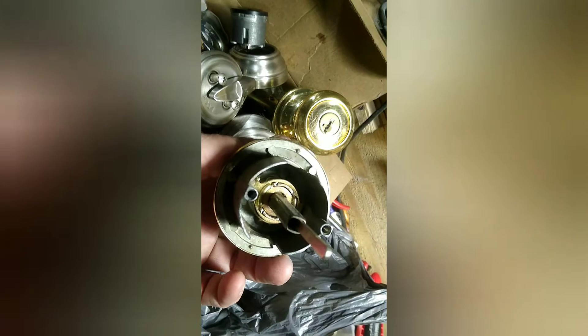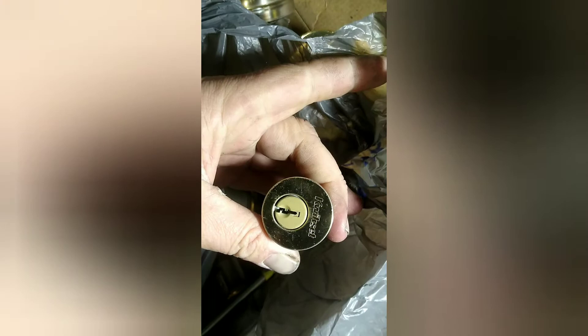You can tell it's Kwikset once you get the hang of it. Also, if they don't say Kwikset and it points to the right, you know it's a Dexter or something like that — they have the little Kwikset cylinders in there, which are fun. These are 50 cents — I'll keep these for work. When you get into stuff like this, I used to get these all the time for little to nothing, take them apart, rekey them, repin them.